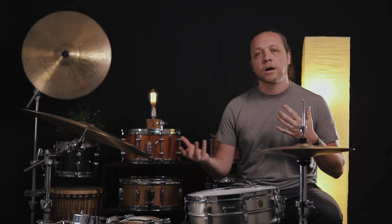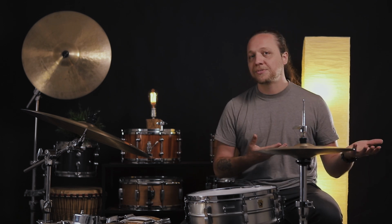And the amount of material that you take away really influences the behavior of the cymbal, because when you have a piece of metal directly out of the smelting process, it's not the same hardness all the way through. It's not the same molecular structure all the way through. It's not totally homogeneous. So a good cymbalsmith is going to understand how to work with a blank to get a sound that appears possible over the course of the production. And sometimes the sound you want is not possible with that blank, and other times it tells you exactly what it wants to do and just leads you down the path.